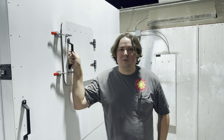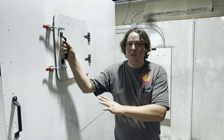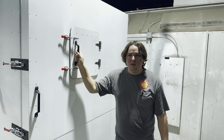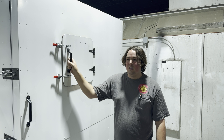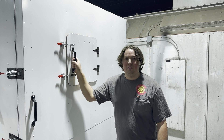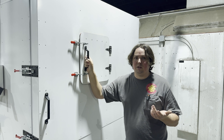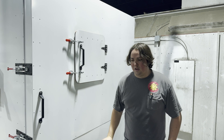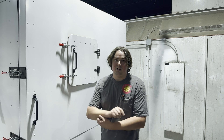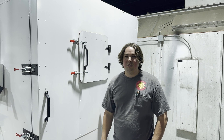Pricing-wise, as you probably know from the thumbnail, we came in right around $5,000 on the build for this oven. That is basically everything we had to buy to make this, including budgeting in a 100-pound propane tank — though you can use smaller ones and save some money. We just used the bigger ones for extra burn time. The price will fluctuate a lot based on your metal price. This uses 16 sheets of 20-gauge 4x10 sheet metal, and two 4x10 sheets of 16-gauge for the floor to help reduce heat loss into the concrete.